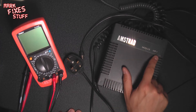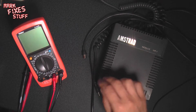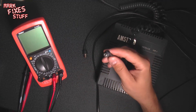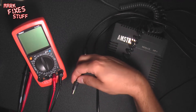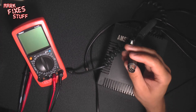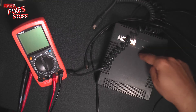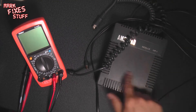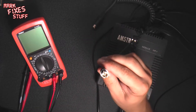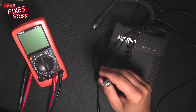The monitor showed the picture from this, powering the computer with the 5V. If you had the MP1, then what this would do - it's a modulator - it would take the mains power, give you 5V and 2A into this barrel plug which goes into the back of your CPC 464 to power it. And then a DIN plug that goes into the monitor socket on the CPC 464. It would take that monitor signal in here and modulate it into an RF signal which went into the back of your TV, and you would tune that in using the RF tuner.